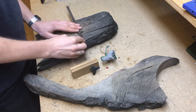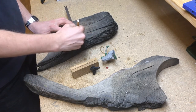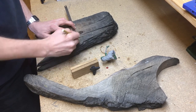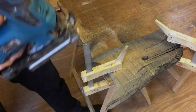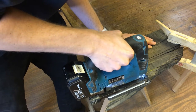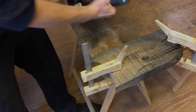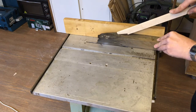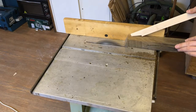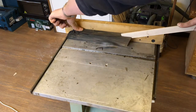Some of the pieces are almost falling off so I didn't know how the wood would react to being cut. I carefully measured out a piece that I thought would hold up and really hoped the rough outside would remain intact for the plinth. I roughly cut out the pieces with a jigsaw — a bandsaw would have been more precise but I didn't have one available. After that I carefully cut off more and more of the wood on the table saw, preferring multiple cuts instead of one for more precision and to put less stress on the nearly falling-apart wood.